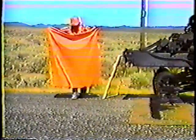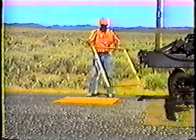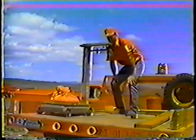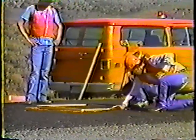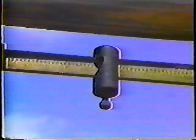To check the application of the cover material, place something to collect it at the beginning of the test strip, let the chip spreader pass over it, and then weigh the cover material. The crew is using a frame with an inside dimension of exactly one square yard — they place the frame over a piece of fabric, the chip spreader passes over, then excess material outside the frame is removed. To find the application rate, all that's left is to weigh the material. In this case the cover material weighs 22 pounds, so the application rate is 22 pounds per square yard.